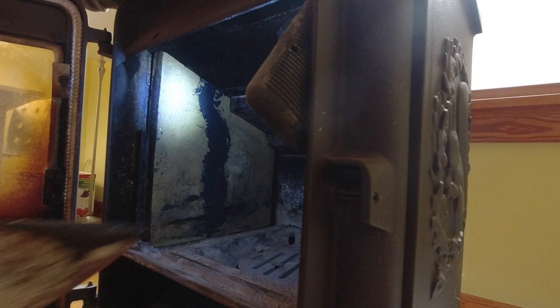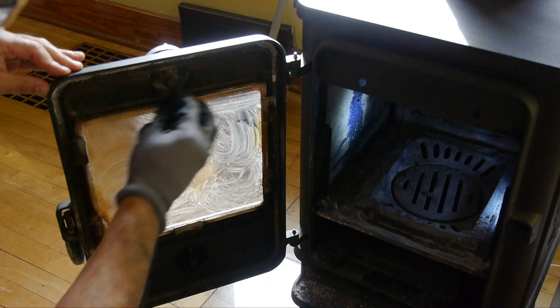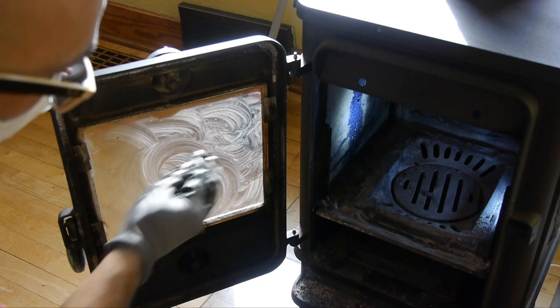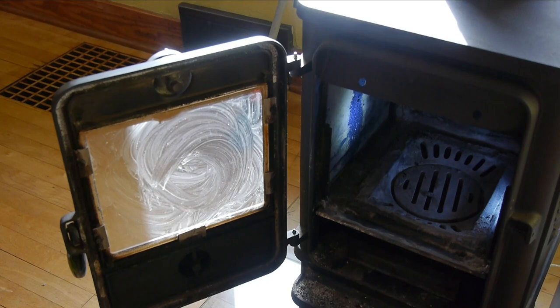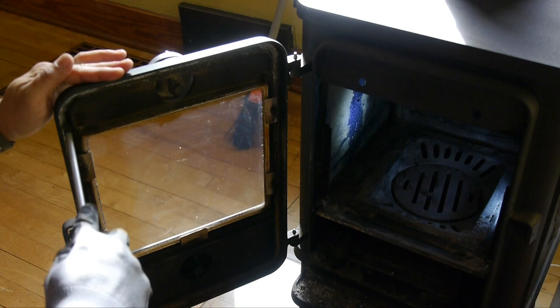Now on to cleaning the wood stove viewing glass. This is one of the weird things in the world where they sell fireplace window cleaner, but the best thing is to use the ash. What I've got here is just a paper towel that's kind of wet — draw up some of the ash and then just use it as a mild abrasive. Even the soot that's really, really carbonized and you wouldn't think would come off, comes off. It's almost like nothing can clean the soot off these windows except itself. You can see that cleans up real nice.